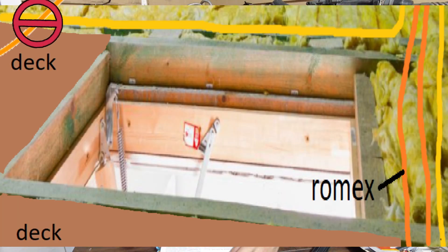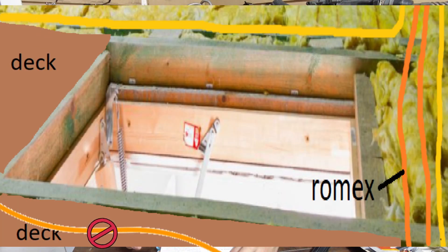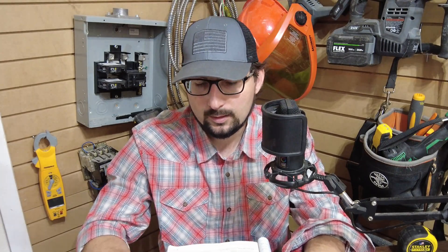Here's another one — completely not acceptable per the NEC or common sense standards. This one here has the romex on the plywood decking. I've drawn the romex in myself in paint, but you can get the idea — if you have romex on the deck, you simply cannot do it. Here's one going across a step, and how you'd want to put that framing member across the face of it so you can't kick it — maybe cap it off.